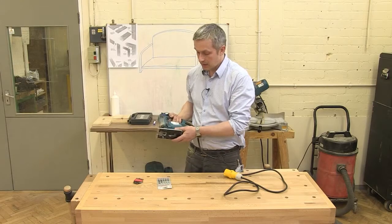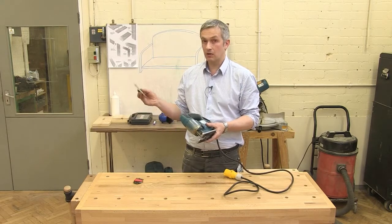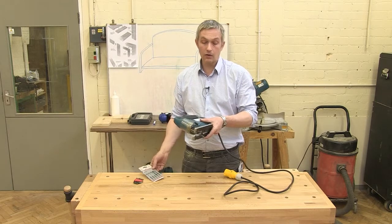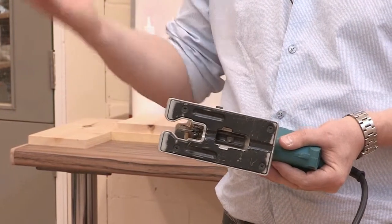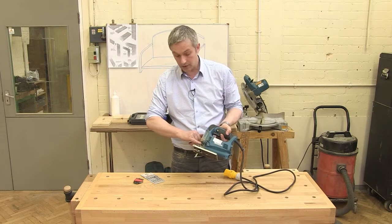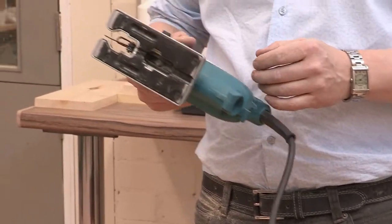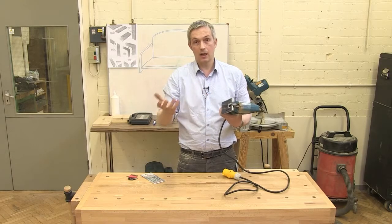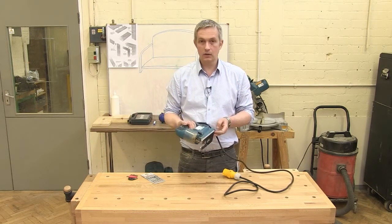What we've got in here is a pretty standard blade designed for this jigsaw and for fairly quick cutting in wood. There are various types so you need to make sure the blade you're buying is compatible with your jigsaw — it's good to ask. On this jigsaw, to change the blade there's a grub screw needing an allen key — just undo that, take the blade out and replace it. A lot of jigsaws these days have a bayonet fitting where the blade goes in and you twist it. The instructions for blade fitting will come with the tool, and it's always good to ask in the shop when you buy it.